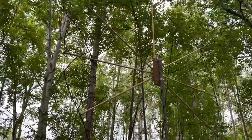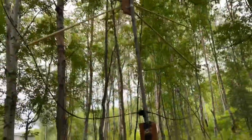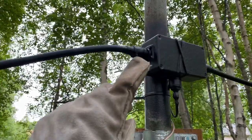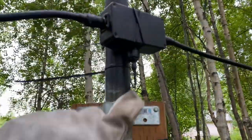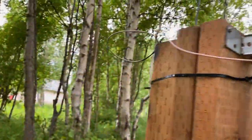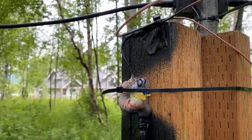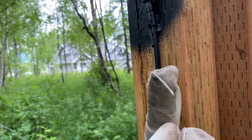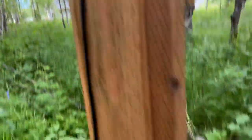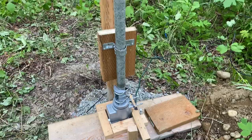We built this second 10-foot diameter shielded loop, which has got a little amplifier in it. Everything's sprayed with a bitumen composite to stop water. The amplifier is in here. The power gets fed up from the center of the coax. This is a common mode choke, which is wound around the coax to stop the noise from the shack — the radio room — coming up the outer of the coax and getting superimposed. Down at the bottom we have one of those cheap TV rotators, and we can rotate the antenna.